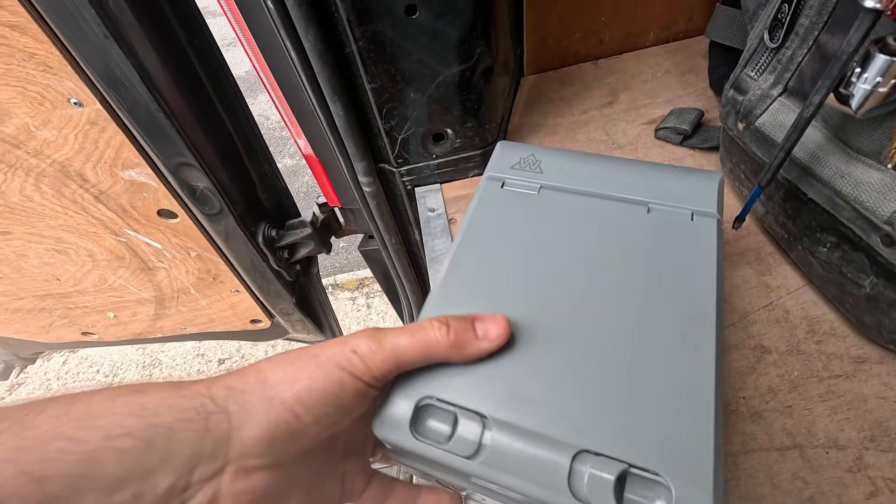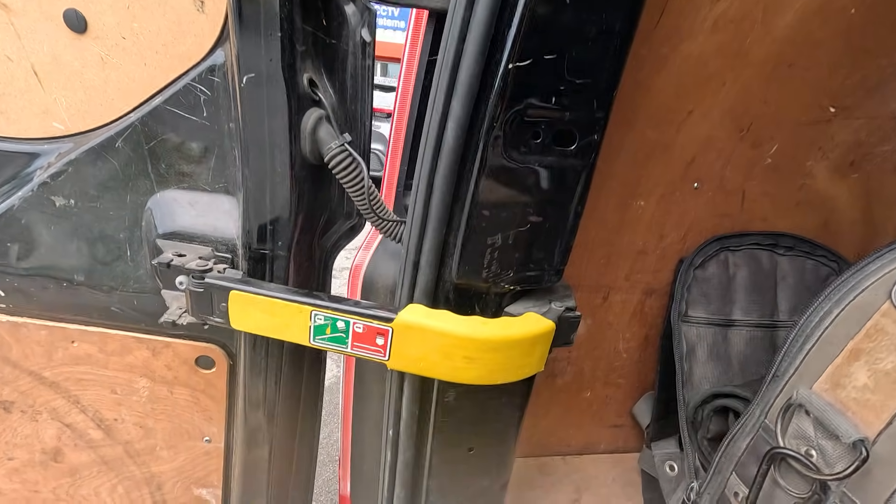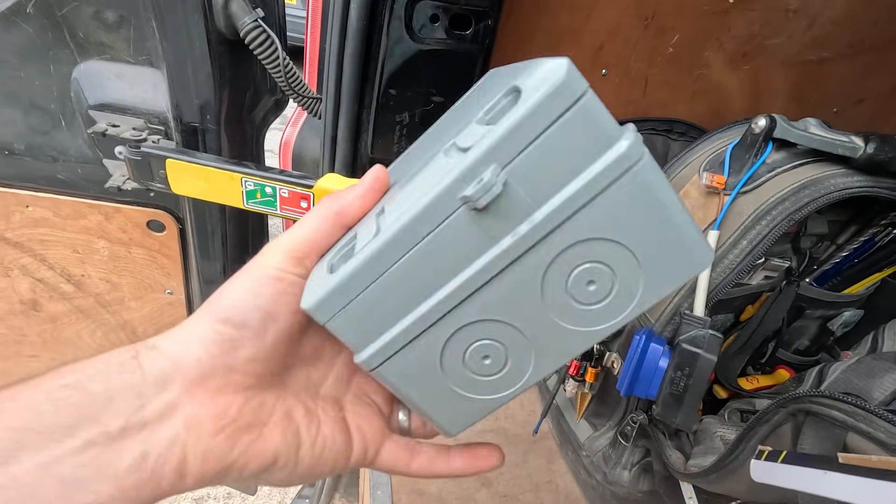You can sort that outside — drill through into your outside box, nick your tails and then blend out of that into your EV charger. A nice little top tip if you're doing EV installs. They meet regs, and it helps you compete when people like Octopus are offering charger installs for 999 quid including the unit. We're doing a charger for 750 plus materials, which is quite hard to compete with.